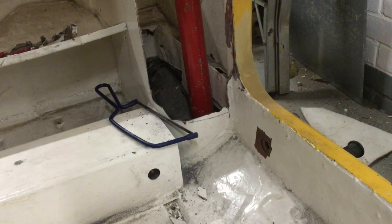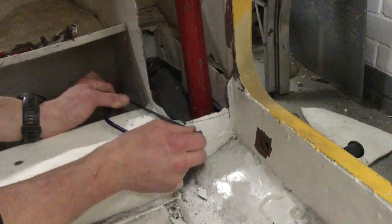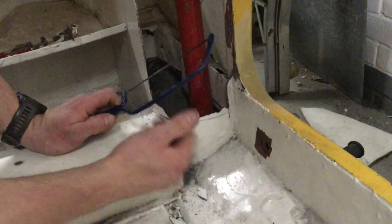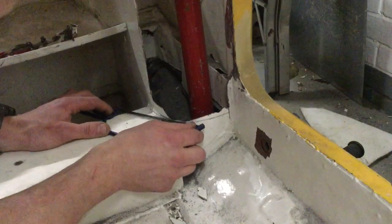I've been reduced to manual slashing now because of the angle in there — it's very tight and I want to get it as close as I can to the cut line. I know you might be shouting at the camera wondering why I'm not cutting that way, but I haven't taken enough material off this end and it's making my blade bend. Getting there now — going to have to carry on with the little junior hacksaw along the bottom, it's just too tight to get anything else in. I'm waiting for some little cutters for my new die grinder which will be absolutely perfect for this job, but it'll probably be done by the time they turn up.